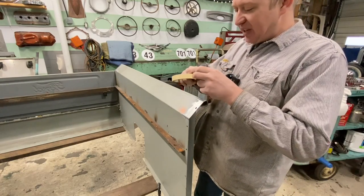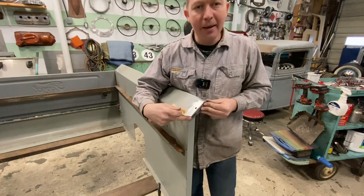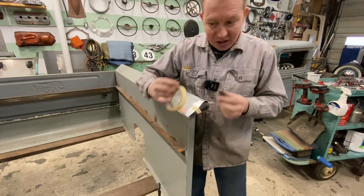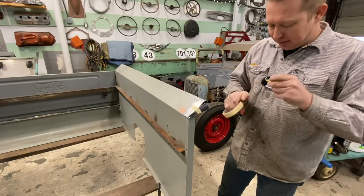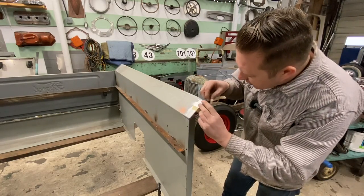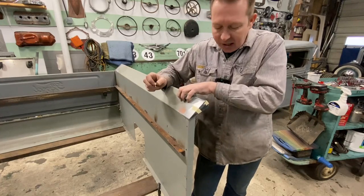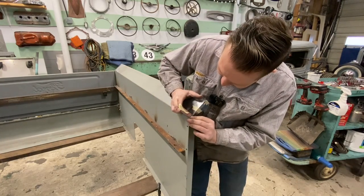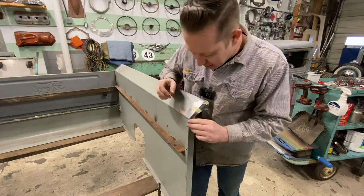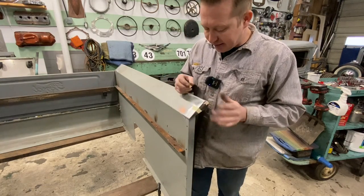When we fit these, there are a couple ways you can do it. Some people like to use magnets, but I'm personally not really a fan of magnets for little pieces like this because the magnet kind of messes with the weld — the weld gets all funny. So I'm just going to use simple old-fashioned masking tape, because we just need to hold it long enough to get a couple tacks on there. These fit really flush, and they're a little bit heavier than the box itself. The box is 16-gauge and I make these out of 12-gauge, so they're a little bit thicker, which lets you finesse and grind it to fit a little better. We'll pull the welder over, give it a couple tacks, take the tape off, and then we can weld this up.